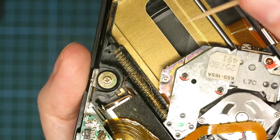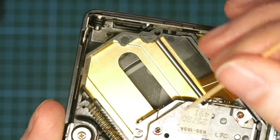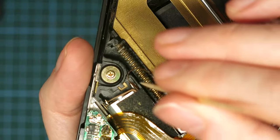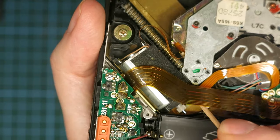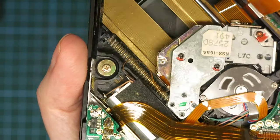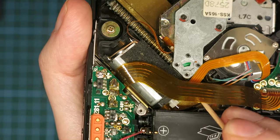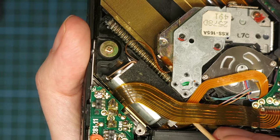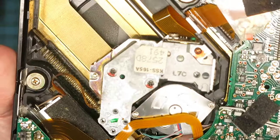Where it can seize up is the rails of the sled — the grease can dry out on the worm gear there, which puts extra tension on these plastic gears that are already nearly 40 years old. It puts extra stress on something that's already of an age and they crack. So that's definitely an issue.